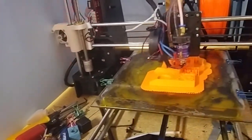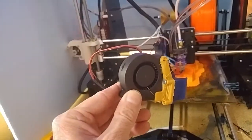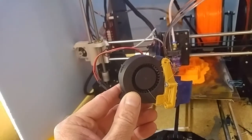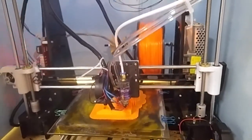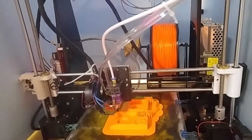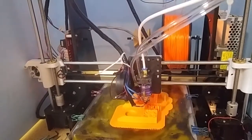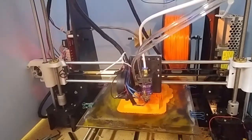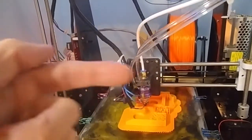There was nothing I could do to fix it. I did go and use a blower and this improved things, but what would happen, I believe, is that my filament — because it's in my garage, it's humid. I live in Houston, Texas: 100% humidity, a lot of heat, a lot of water. I believe the filament would absorb water and then allow that heat to work up the tube faster than it would if it were dry.